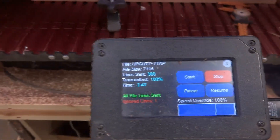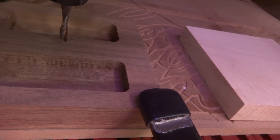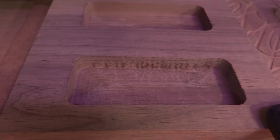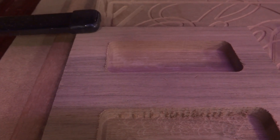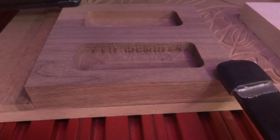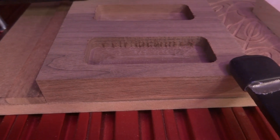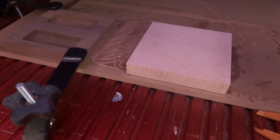So we finished that up in three minutes and 43 seconds — of course I was running 100% speed. From what I can tell right off the bat, the climb cut was not nearly as smooth of a cut. I've always kind of wondered, and it kind of seemed like the conventional cut wasn't always the best finish on the bottom, but as you can see here, this climb cut just didn't really give a very good cut at all. So I'm most definitely going to stick with the conventional cut. You can notice that the climb cut does peel larger chunks away just the way it runs. I have a feeling maybe if I slowed it down a little bit it might get a better cut, but time is money in these applications. What we will do is add the maple — of course maple is a lot harder than walnut, and walnut seems to cut like butter — so we'll take a little chance and see how the maple does.